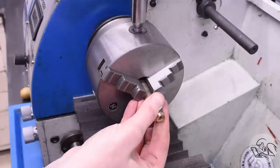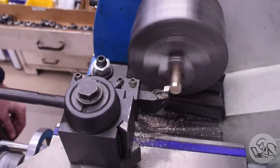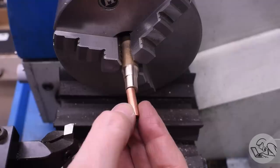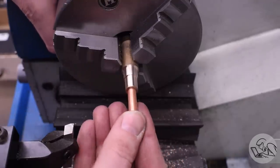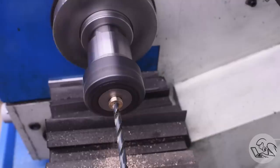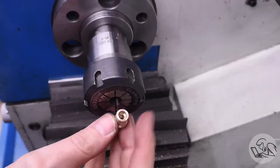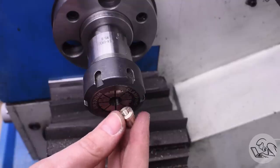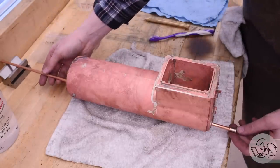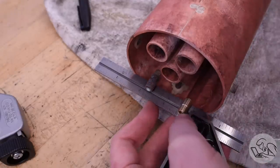Quick detour over to the lathe now — I need to make some bronze fittings for the blower pipe. The blower pipe is a pipe that goes from the back head all the way through the boiler straight through to the smoke box. What it does is allow you to create draft with steam — it's essentially a steam bellows. Steam engines are very clever and they find ways to do everything a locomotive needs to do with steam. One of those jobs is creating draft for the fire, because the heat of a coal fire is a function of how much air it can get. The blower pipe helps by funneling steam straight out the chimney, which creates draft through the smoke tubes and draws air into the fire from the back of the firebox.